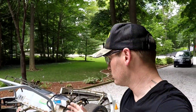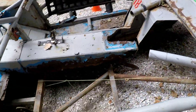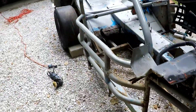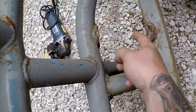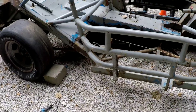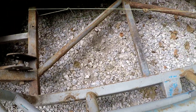Derek and I have been talking about wire brushing the whole thing or sandblasting the chassis. I've got the wire brush out here — what I'm going to do is just hit this all up with the wire brush and see how the surface rust comes off. It'd be nice to put a nice coat of black on some of this, just start cleaning it up a bit. There are parts of the car that have been modified since it was originally built — this weld is missing halfway around, so a little janky. Anywhere I come across that I'm just going to leave the paint off so we can come back, clean it up, and throw some more weld on.